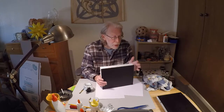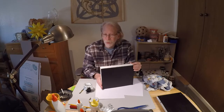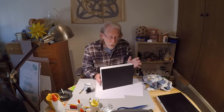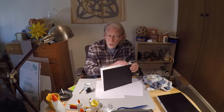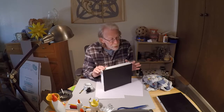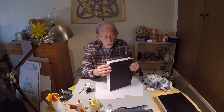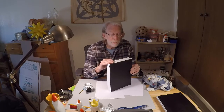As long as you take note of which side you're starting on, you won't get confused, because it can be confusing doing three coats on all the sides, because you have to split it up a little bit. I start on the long side first, far corner, so that by the time I'm down to here and doing this point of it, this edge is dry enough for me to then turn it this way and do the top or bottom, in this case, side.